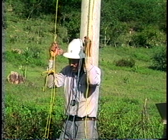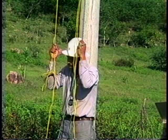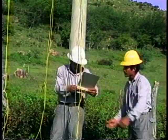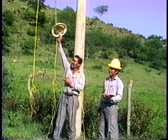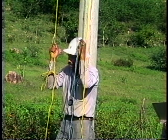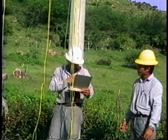The rest of the conductors are brought into sag using the first conductor sagged as a reference. This is done by inducing waves on the sagged conductor and a second conductor at the same time. If the second wave return is slower or faster than the sagged conductor, the supervisor motions to the hoist operator to adjust tension. This is repeated until the wave cycles on the two conductors are equal.